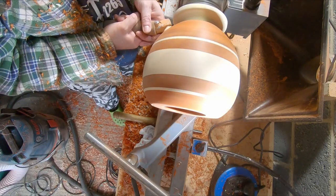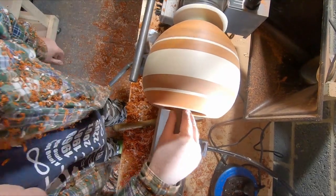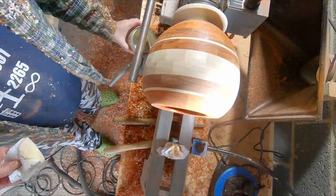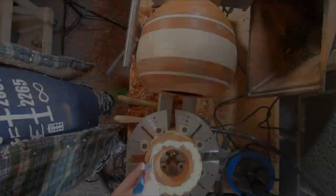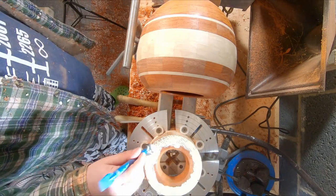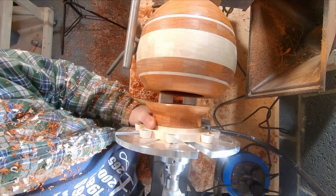I did some sanding both inside and out from 80 to 180 grit. I then used sanding sealer on the inside and finished it off with Wood Wax 22 just to seal the wood. In the next clip you can see a bit of a dodgy move — I have my hand inside the workpiece polishing the wax off the surface, but note I have my left hand on the speed control so if anything happened I would be able to quickly stop the lathe. With the inside finished I glued the top section on, mounted in the cole jaws. This made it easy to bring the tail stock up to add clamping pressure and keep everything centred.